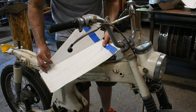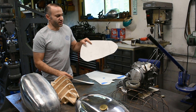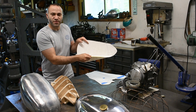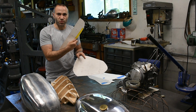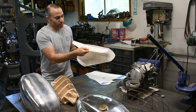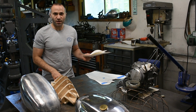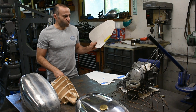Let's bring these over to the table and I'll show you what I do with these patterns to make your tank. Once you've got your patterns made — one thing I forgot to mention is on your side profile, make sure you mark where the other profiles correspond. The reason being is the top profile could be in the middle, up high, or wherever, so I need to know where that profile goes. Also, you can make multiple profiles — let's say the top of your tank has a real low crown area and you want to show me what the shape of that looks like. Once you get all your profiles made, fold them up, stick them in the mailer, and send them over to me. Please reach out to me first — I have a wait list, and if patterns just show up in the mail it would be a nightmare.